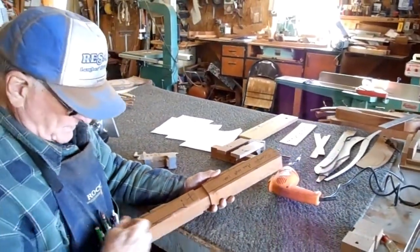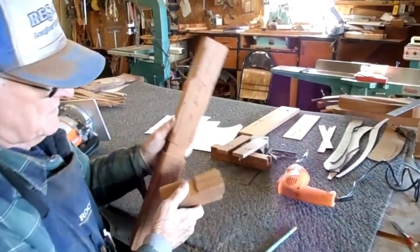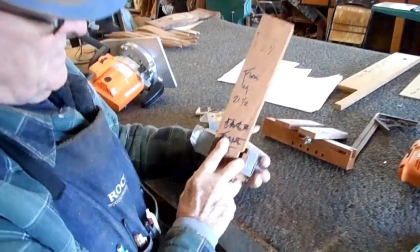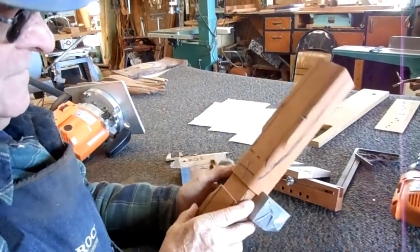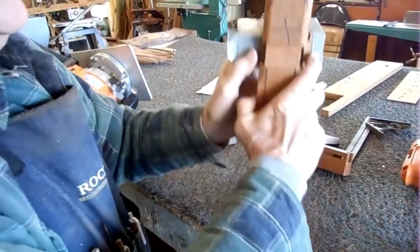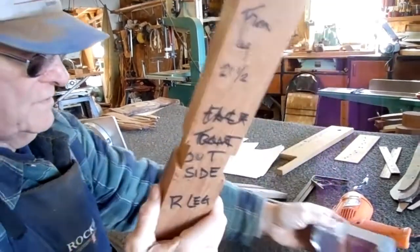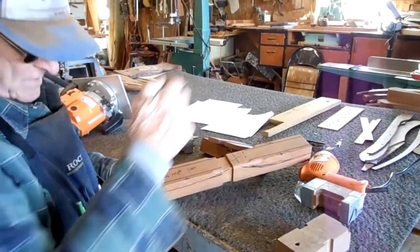Now, once you've done that, you come down to this area of the chair that's going to be exposed. This is the seat, this is the leg, and you see all of this stuff in here. This is coming off so that it's even with this edge here. And this that sticks out — this will be cleaned up here, this edge will be taken off. So you mark your leg to this area here and cut it off on the bandsaw.